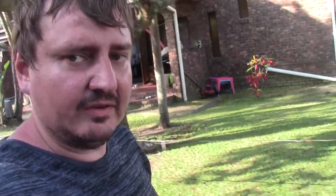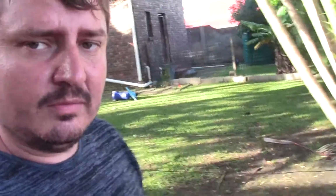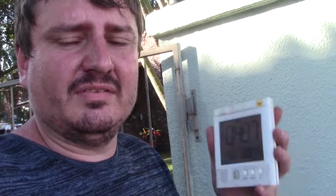Okay, so now I've got the energy monitor up in the house's distribution board, which is fed from the meter out in the street. So I'm going to go outside to the street now, take a reading of that meter and the reading at the same time of the energy monitor, just so we can see how they compare. The meter out in the street is billing rated. Basically it's calibrated and things like that, and it's measuring the voltage and the currents to work out the power. It is an old analog meter, so it's not all the new fancy digital ones. This, as you saw, we just put in what voltage we expect, or round about the same, so there will be a slight discrepancy because this thing's not measuring power, it's measuring the current and making an approximation on the power. Let's go out to the street now.